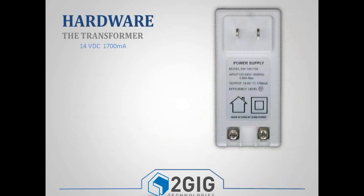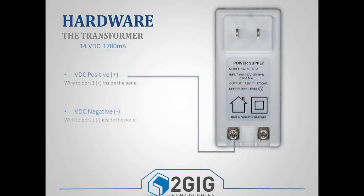All right, moving on to the transformer. The transformer is a 14-volt DC, 1.7 amp transformer. So just make sure you pay attention to the polarity. You've got your positive and your negative. If you plug things in backwards, you're not going to damage the panel. It's protected pretty well. But just make sure, if you ever run into a situation where the panel won't power up, just double check or triple check your wiring.